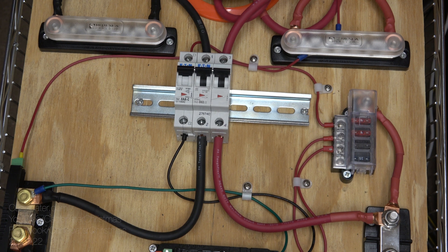The battery has two six-gauge cables between each cell pack, then on the top they combine into one six-gauge cable. Six-gauge cable is rated at about 37 amps max, which equates to about 800-900 watts on the inverter output. As a test I loaded it up to about 50 amps - the cables started warming up, so I didn't leave it on there too long. It occurred to me that in an emergency situation I may need to pull more than 0.2C from the pack.